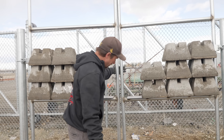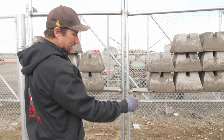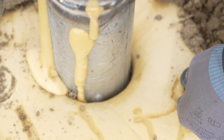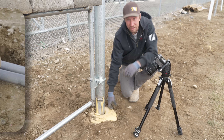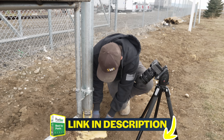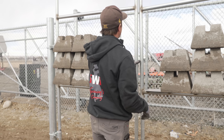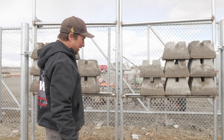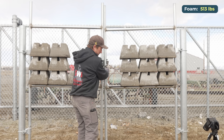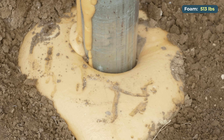We do have a sag there just a little bit. The foam is leaning — both of these gates are level straight across — so I think we do have some settling and stress going on on the foam side versus the concrete side. I don't see anything pulling away. This Post Lock foam is really hard — it's not like the Fast 2K where we can get some give. It's a lot more dense, but I can't get it to snap or make any noise whatsoever. That's pretty impressive. So we're going to have to start transferring weights from the concrete side to the foam side.